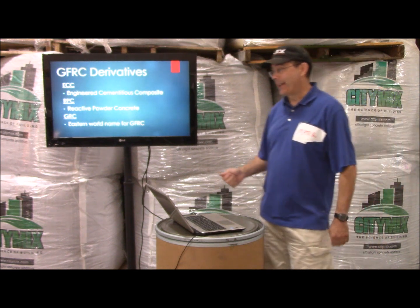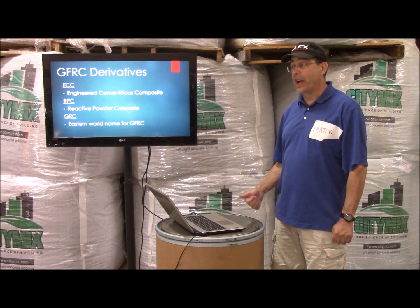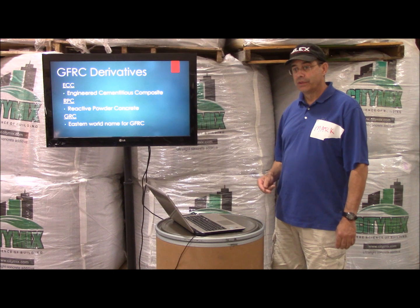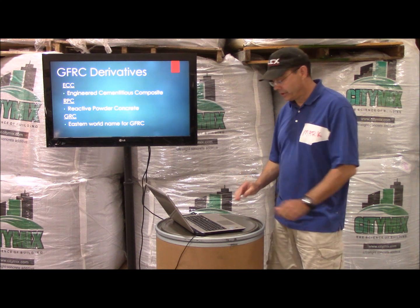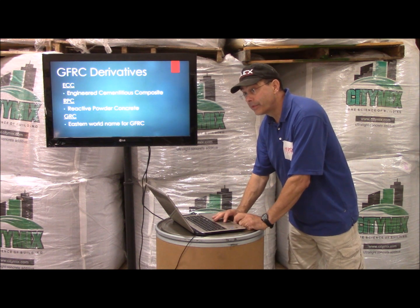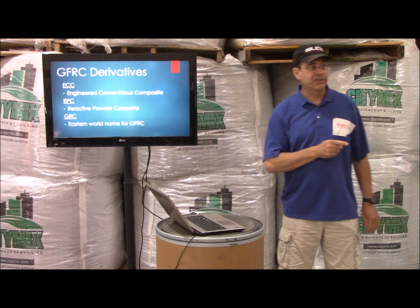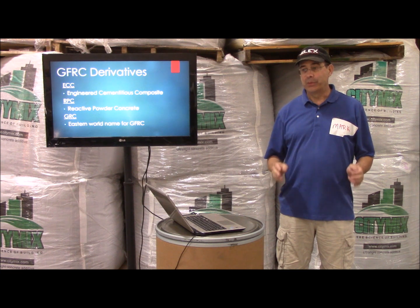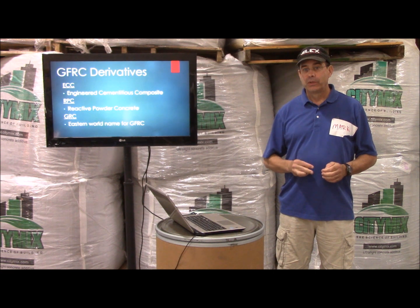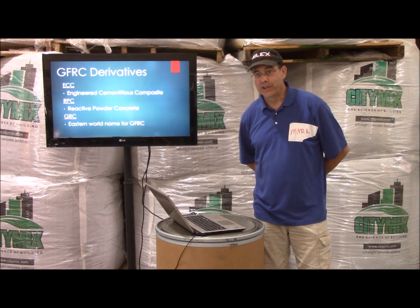The rest of the world calls it GRC — glass reinforced concrete. It's huge in China, the Middle East, Turkey, and Australia is way ahead of us. When asked where RPC would be used: Mike Taylor the tile guy — his mix is basically RPC because he hits around 18,000 psi for tile and direct casts them absolutely flawless with no bug holes. A guy thinking about starting a plant asked if he needs ultra-high performance concrete.